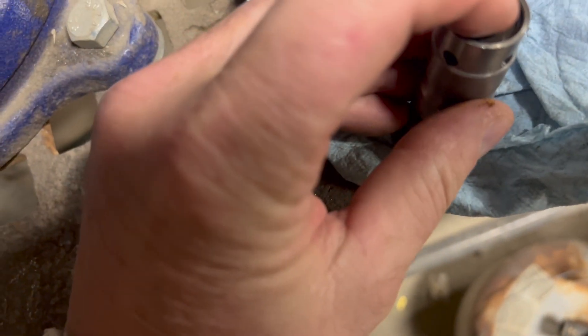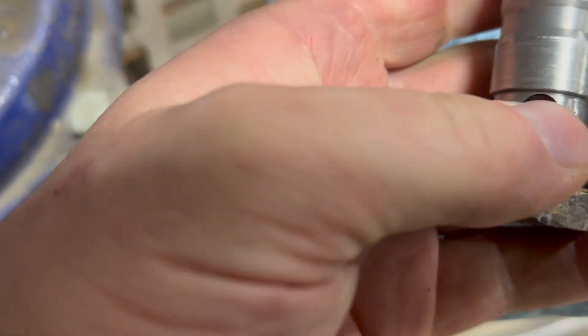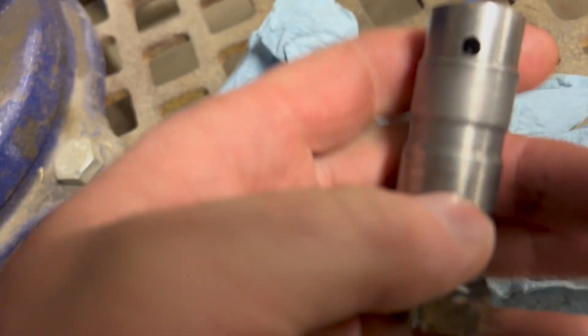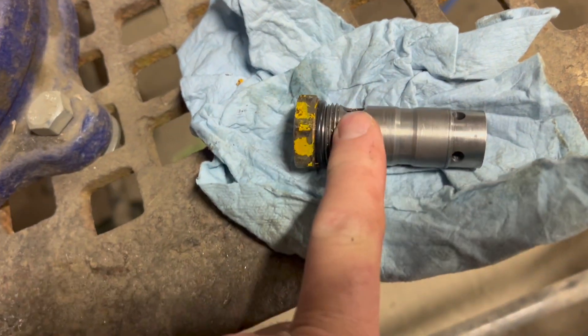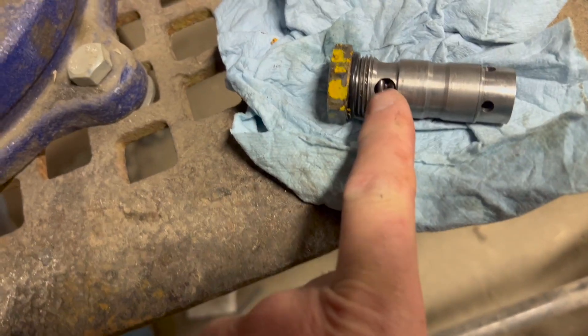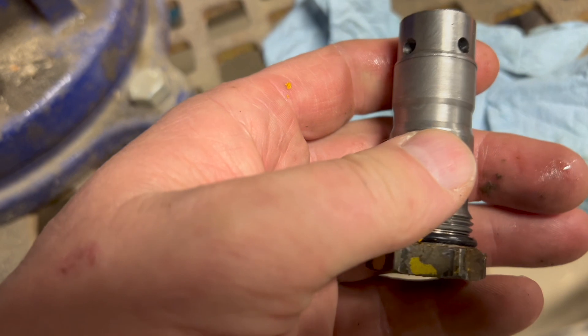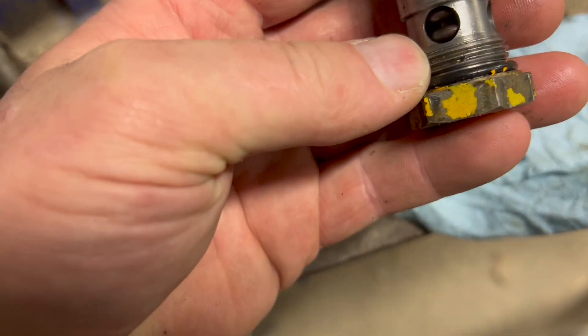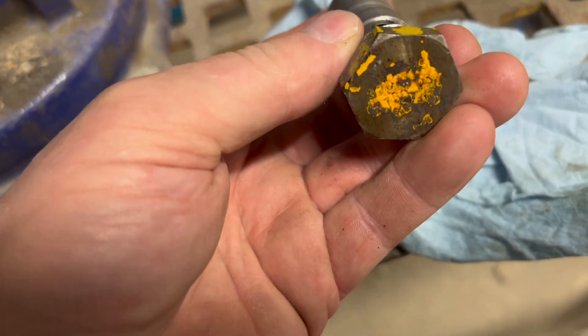Alright, so that disc is still loose. My thought is that it should be resting against the snap ring. I can't put enough pressure on the vise to compress it — bear in mind that relief is set at 2600 pounds, so that's a pretty beefy spring inside of there. I thought about pulling it apart to see if something obvious is wrong, like it's plugged full of dirt or plugged open, and maybe clean it and try to put it back in. But I don't think I'm going to — I'm supposed to have a new one here tomorrow, so I'll wait and put the new one in then. To be continued.